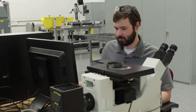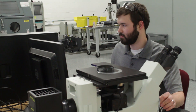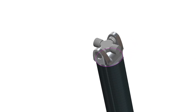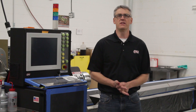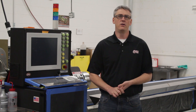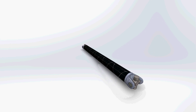The first step of our process begins with our engineering department. We've got a great group of composites engineers who take each individual market's specifications and parameters and custom tailor them for the individual designs. They're able to pull those into our computers and run simulations to check the critical speed, the torsional stiffness, and the overall torsional strength, as well as many other parameters. We can tailor those to your specific application.